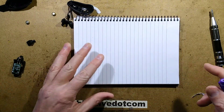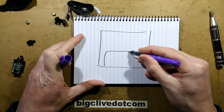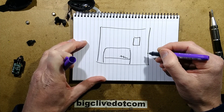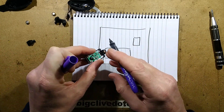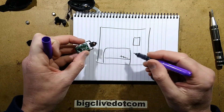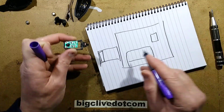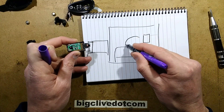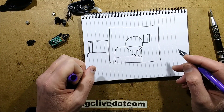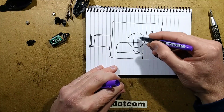So if you were to look at a wall — say, for instance, you're in Dr. Ashen's lab, and that's a wall with the famous Ashen sofa, picture frames and pictures — and imagine you just had a light sensor pointing ambient, just open, it would see the whole area. And you want to actually detect light movement, light modulation. So what you do is put a tube in front of it. In this case they've got the light sensor and they've just got a plastic tube sitting in front of it, which means it now has a narrow beam angle. So when it's looking in whatever direction it's pointing, it sees a small circle of the wall. For best results you should point it at a bright or dark surface if people are wearing bright clothing or are illuminated. It works on the change in light, so when Dr. Ashen walks across there, it will detect his body walking through.